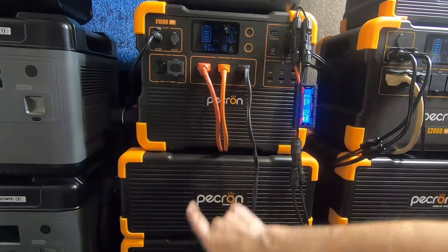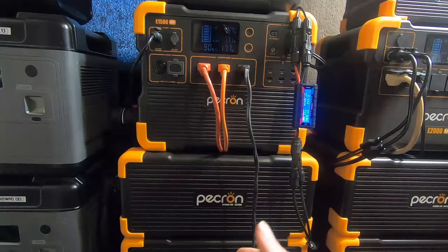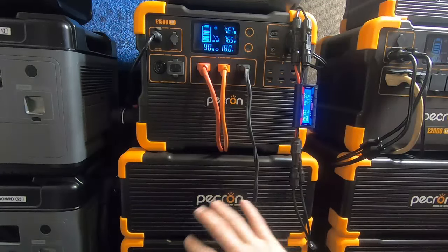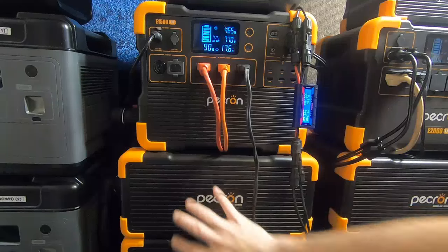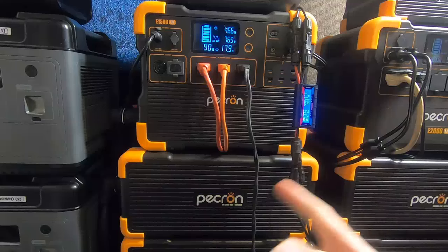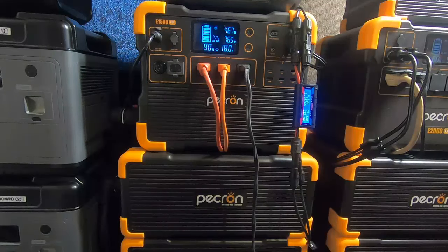Back to the heat gun — 75, 80, 90, 91 degrees on the main string connector — that's nothing, considering you're pushing almost 1,450 watts through the system right now and it's handling it fine. The batteries stay super cool — around 72 to 74 degrees — because the battery cells are so large. I only wish I could put four batteries on here — I'd want six, I'd want eight.